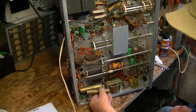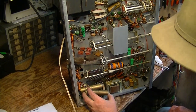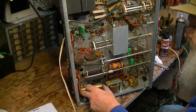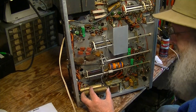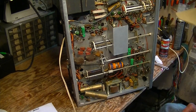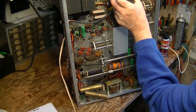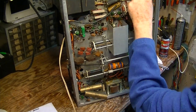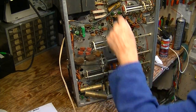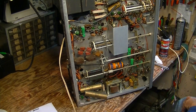Here's the high voltage filter caps in the modulator section, and here's an electrolytic capacitor just hanging there. Somebody has tried to put in new caps — they look pretty old, but they're new caps. And for some reason, one end of it is just hanging out there in space. Somebody has also put in some new filter caps in the plate supply. We don't know whether they're any good or done right — I can see the end of it is split, so those are going to go.